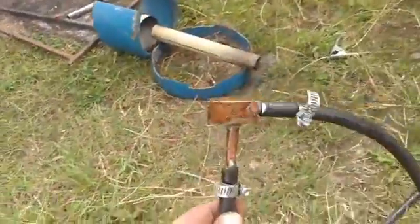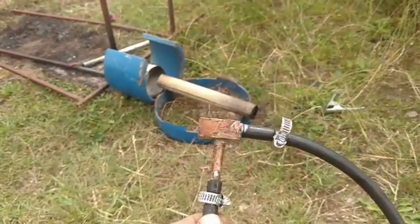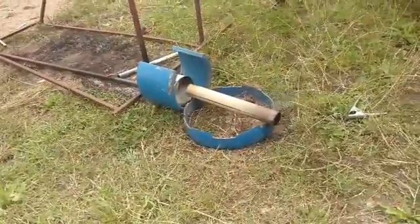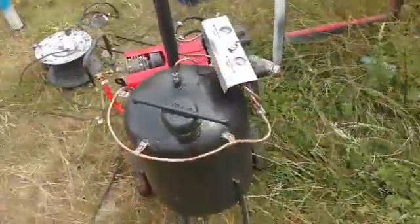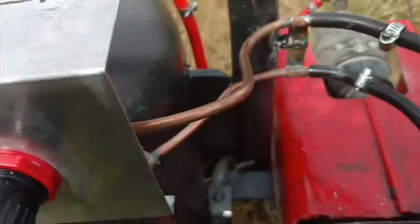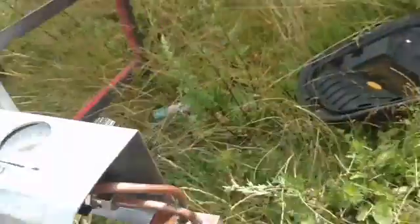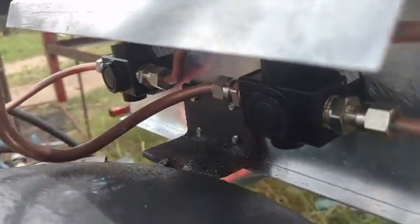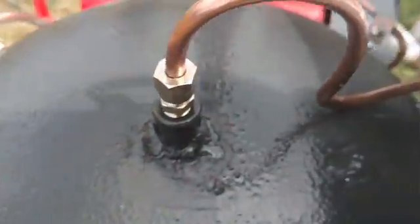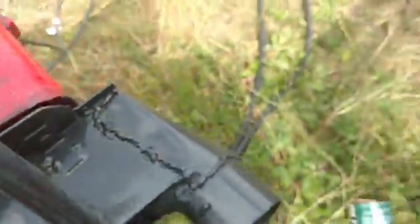So, as you can see, our little bodge-up burner worked okay. It only had a tiny little welding tip in there — we're going to mess around with different tips and try and come up with a furnace or something. We haven't actually used a blower on this outfit yet. We're quite happy with how it turned out. Nice sexy bits of pipe — we've got the compressor outlet feeding this large line going to the T-piece, teeing off into both regulators. The air pressure for the oil then feeds into the top of the tank. We've got the outlet at the bottom of the tank going up the side to this point here, and the airline comes straight out of that air regulator into this pipe — both pipes then feed to the burner.